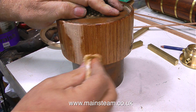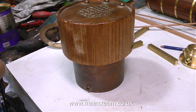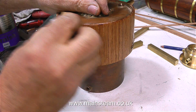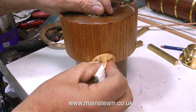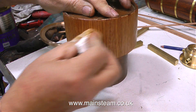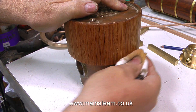Here's another method — possibly a trifle unorthodox. Once you've finished sanding the boiler, do not remove the dust from round the outside edge. Just go straight at it with a cloth and some varnish, which will pick up the dust, and as you go round you're rubbing the dust into any potential gaps in the cladding. This is a polyurethane type varnish and it's oil-based. This is the method I always use, and it seems to work out.